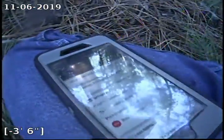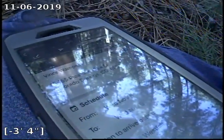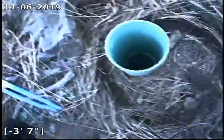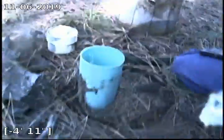Coming out of the clean out once again. Once again, we're at 15455, excuse me, Pleasant View Drive, 80921. Scoped the main sewer line from this clean out here by the wishing well in the backyard of the home. Ran out 133 feet from this point. The sewer line is in very good condition. Flow is great with no issues.